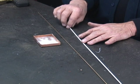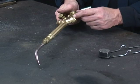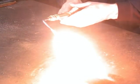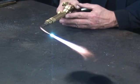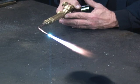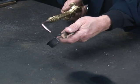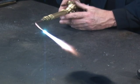This rod comes in 36-inch lengths. Now, the Acetylene and the Oxygen — we're going to open up the Acetylene, then open up the Oxygen, and we have a neutral flame. That's neutral like you put your car in neutral. Let's do that again: open up the Acetylene, use the sparker, add the Oxygen, and bring it back to a neutral flame.